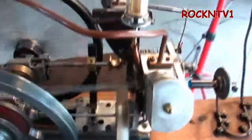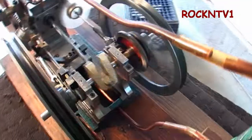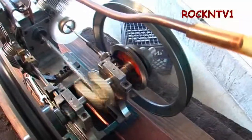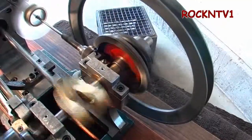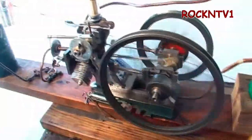The oil drips into the top of the tubing that goes down into the cylinder — one drip per cycle, depending on how fast it's running. The gear that comes off one of those old handbrake screws — I had to straighten that gear in every way, shape, or form because they never planned on it running like that. It is an antique gear. I had to turn both the bore and the gear seam so they were straight on both sides. I made the attachment point, the drafting — everything. Everything is handmade, all of it — well, 95% of it is machined. Thanks for watching, guys.